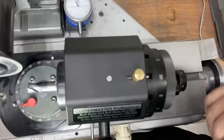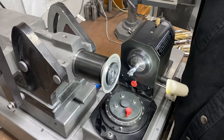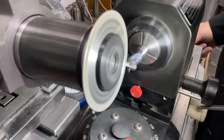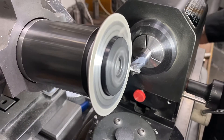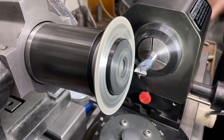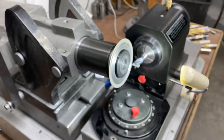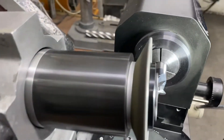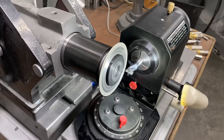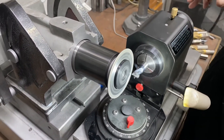You're going to be indexed around using the four-flute slots. Let's grind the secondaries. It's a very aggressive wheel. This wheel has been designed with a little bit of a radius on it. That radius is problematic when it comes to center because it will leave a little protrusion. We'll show you how to get rid of that protrusion on this style of machine with a pretty easy step. We're going to take about 10 thou off this secondary — you can see it cuts pretty fast.